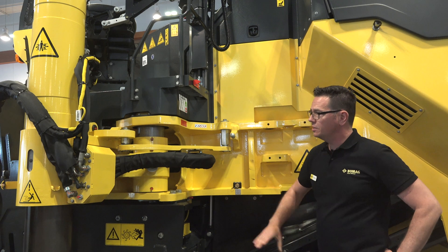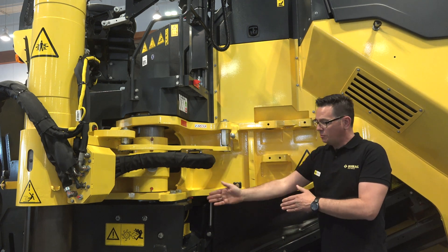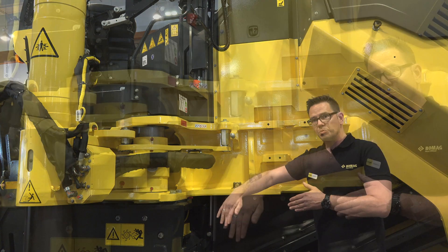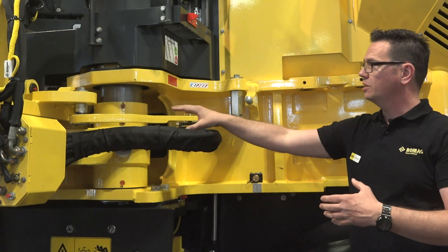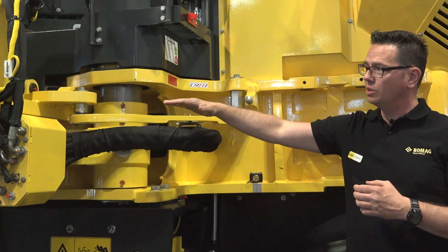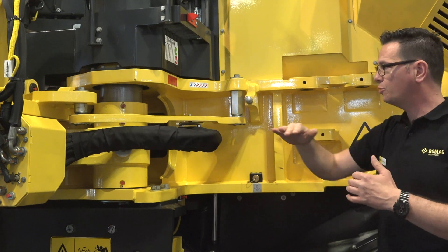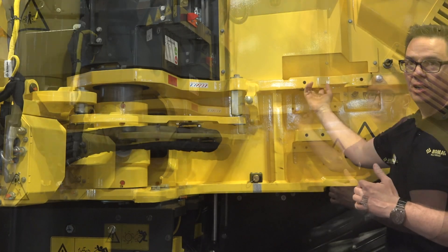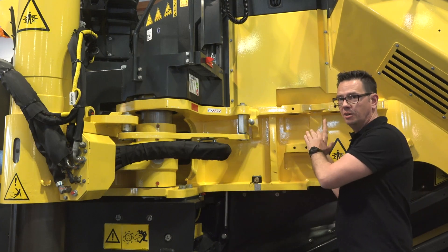Some job sites require that the leg on such a machine has to slew in so the operator gets a better view to the side door and more clearance. Our design is based on a very reliable slew-like mechanism that hooks into the frame. When the leg is slewed in, the machine lowers, the wheel comes down, moves over, and hooks into the frame, so every load goes from the column into the frame.